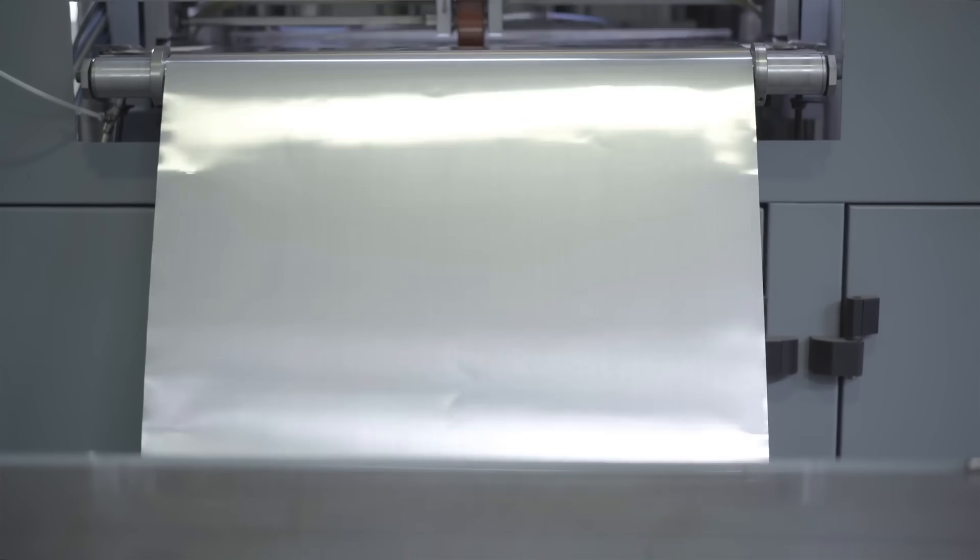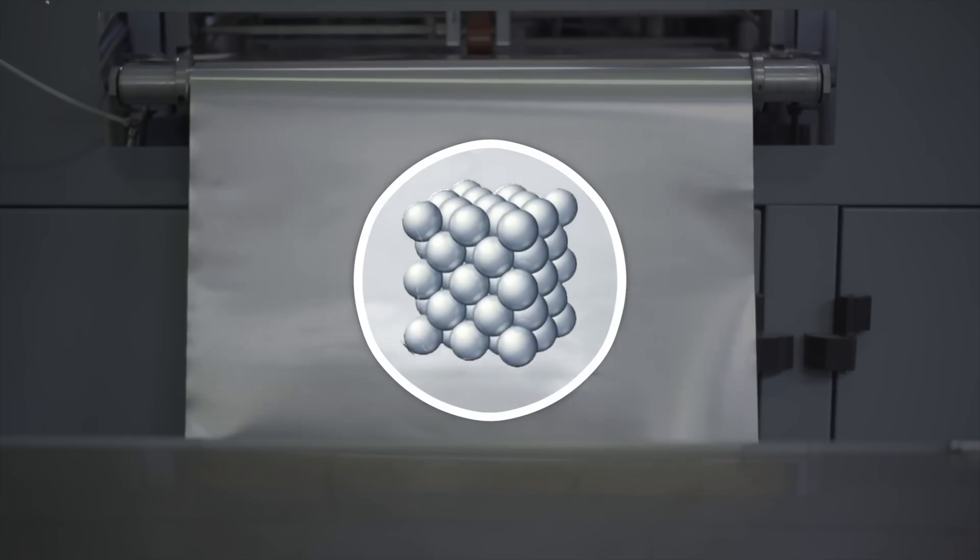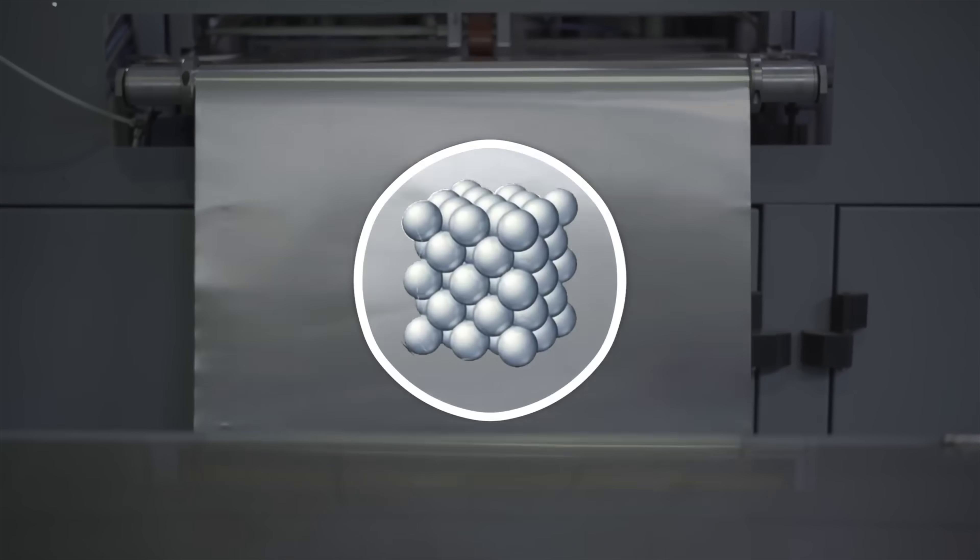Only the surface area of this aluminum foil has the potential to accumulate ions. So you want the electrodes to be as thin as possible. While this aluminum foil seems thin, on the atomic scale it's about 200,000 atoms thick.